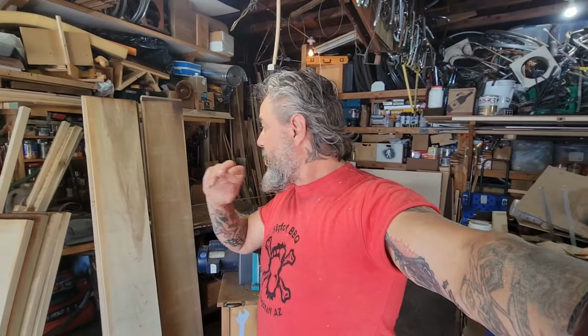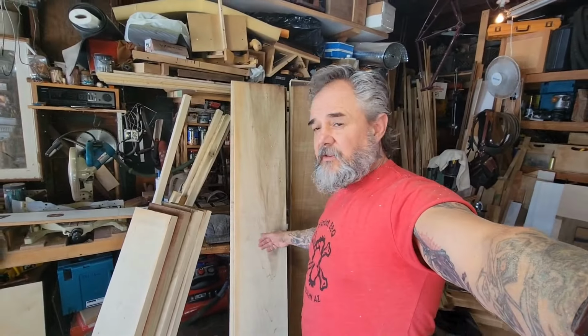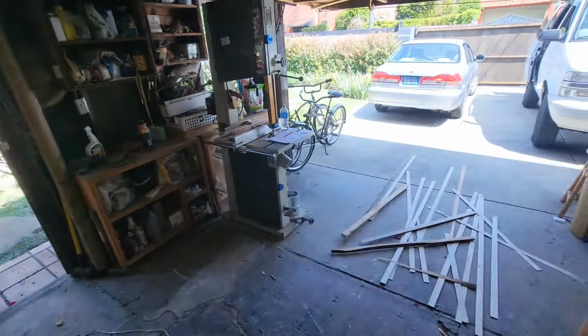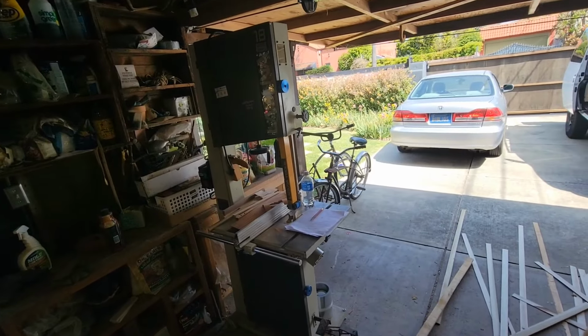The plan is, you guys know how I mill things by now, I'll face joint all these boards here. That means making one side perfectly flat, and I'll tip it on end, and I'll get an edge here, 90 degrees, perfect. And then I take it over to the bandsaw, and I thickness it there, vertically. Then I let it sit overnight.